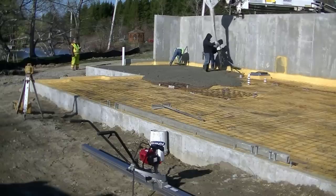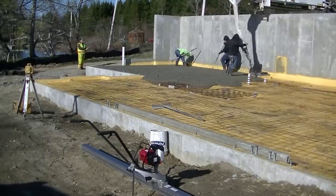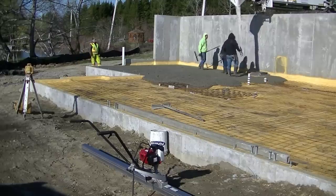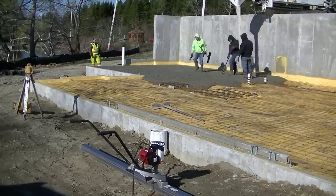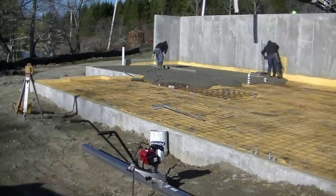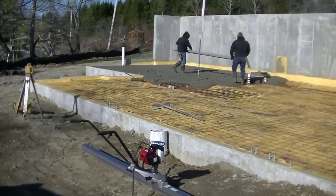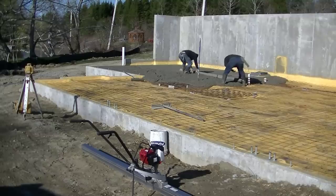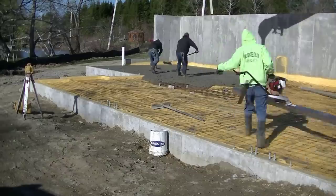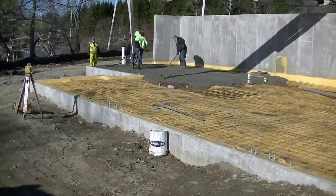You can see the conveyor makes it a little easier — it puts the concrete pretty much right where you want it. They put blown-in styrofoam down; that's what that yellow foam is under the floor. Then they got wire mesh in there and some rebar where there's going to be a big chimney pad. They blew the styrofoam right on the gravel and up the wall about a foot in the back.